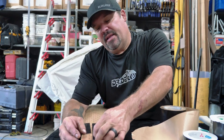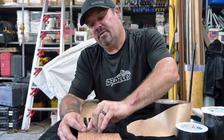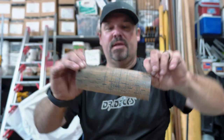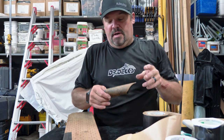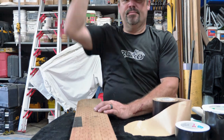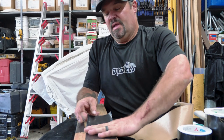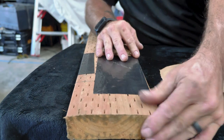What's cool about this g-tape is if you don't like the way it's laid down, you can actually peel it back. You'll notice a little bit of treatment on the tape — you can see the incisions on the inside of the acrylic, showing how quickly it adheres to pressure-treated lumber. It's still sticky enough to reapply, so if you totally mess it up, just pull it up and do it again. Your margin for error is greater — you can get wrinkles in it, but the more you practice the better.